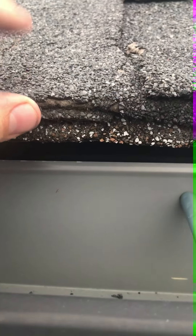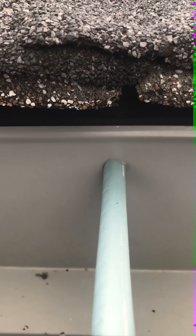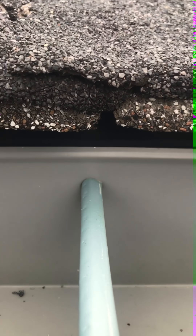Also, one thing: currently there is no drip edge installed, so you just have a layer of poly that'll go about three feet up. They used a different shingle for the starter, and then there's lots of delamination obviously occurring. I'm sure you've noticed that. Gutters are in good shape; there are some spots where they're not draining properly, but otherwise they're okay.